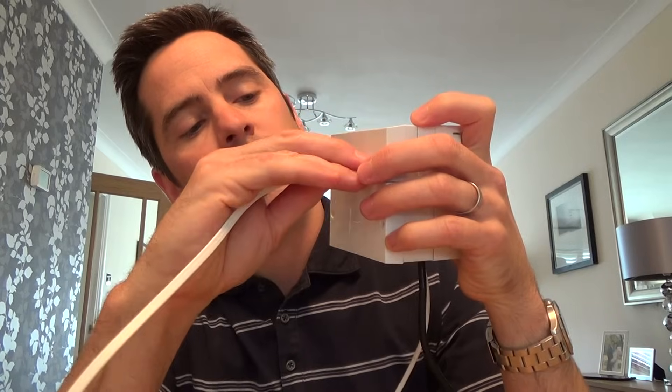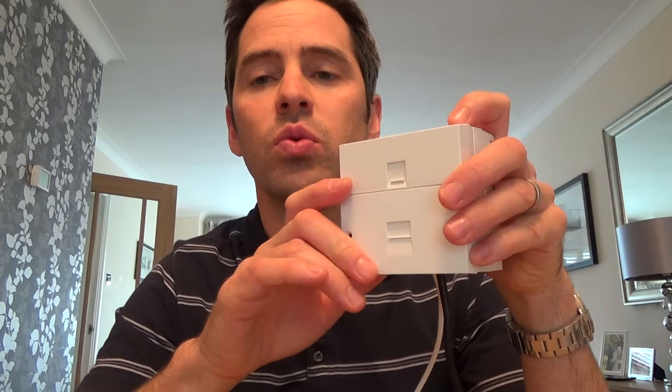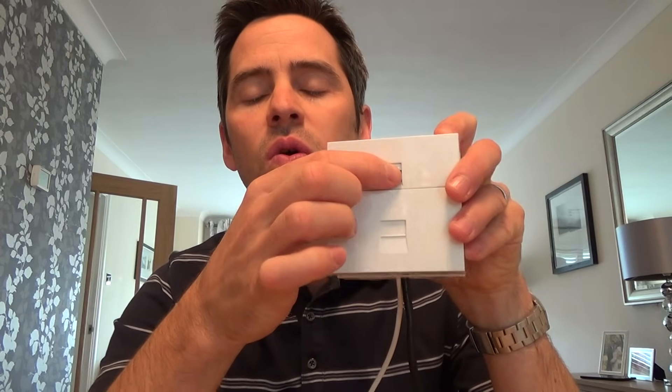You plug your phone line into the bottom socket here and you plug the cable that goes to your router or modem into the top one here. So the bottom is your normal phone socket and the top is an RJ11/RJ45 socket. With this VDSL faceplate you have to use your router by the master socket — your router will no longer work in your extension sockets because the filtering has been done here. Your extension sockets now carry the filtered signal while this top socket here is the unfiltered signal.